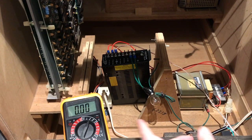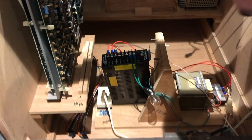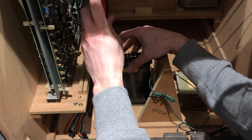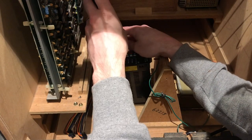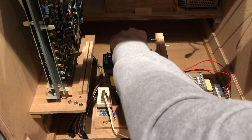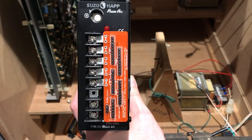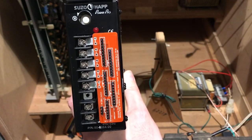We can turn that off now. We know the board is set at a safe five volts - it's not too high. We'll put that to one side, unplug the light because we're done with that. I'm going to unplug our AC and ground just so I can put the adapter board connector on. Let's remove that and put that to one side - this is just so I can fit our adapter board.